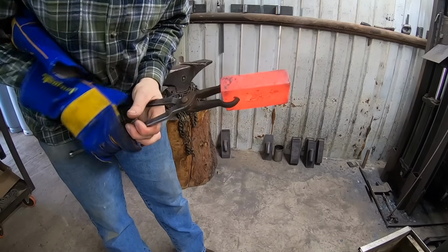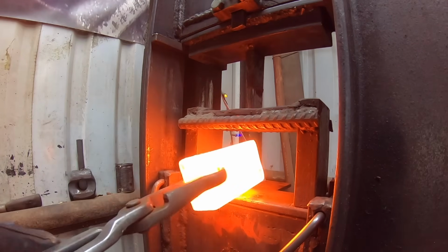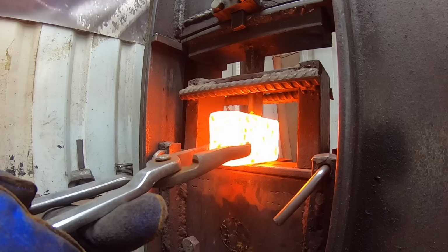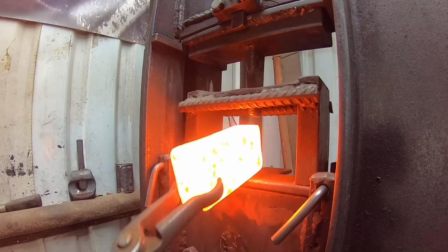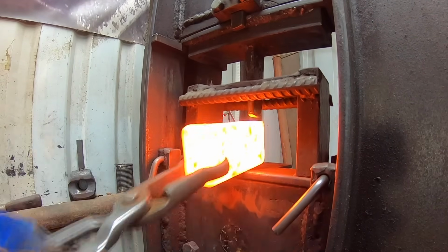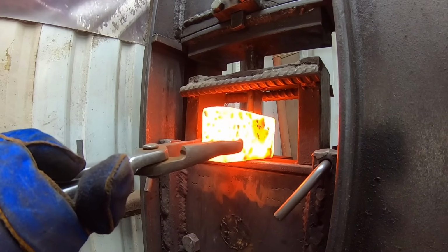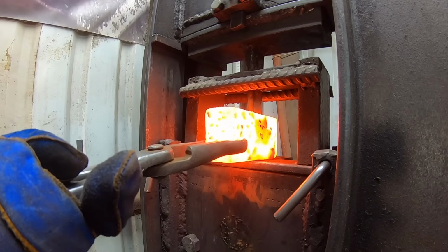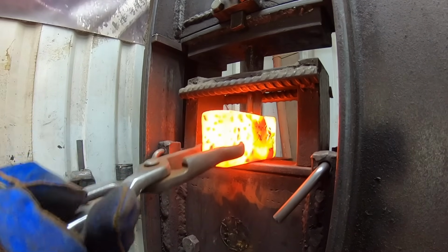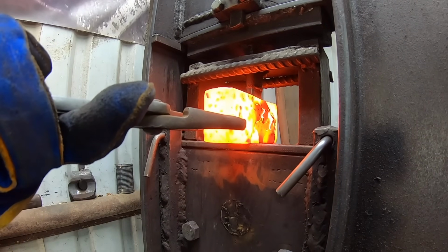See how much wider, we're about 1.25 inches. So we're jumping back and forth between a few different things today because that's what I did over the last couple of days as the billet was heating up. A lot of smithing is understanding where your material needs to be before you even start forging. And so working this billet down to about 1.25 inches or 1.375 inches wide or thick by these other dimensions was necessary in order to actually forge the axe that we're looking for.